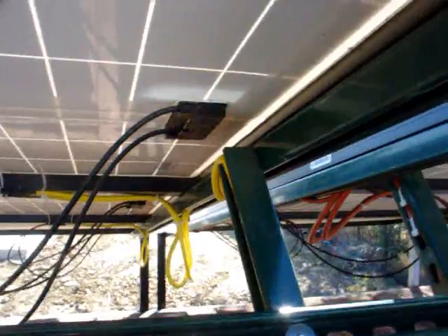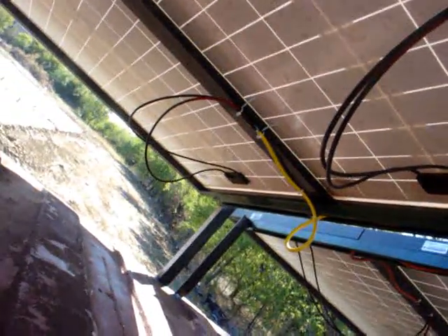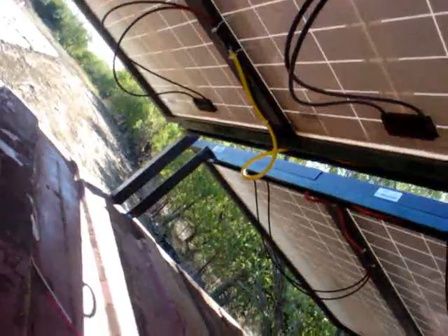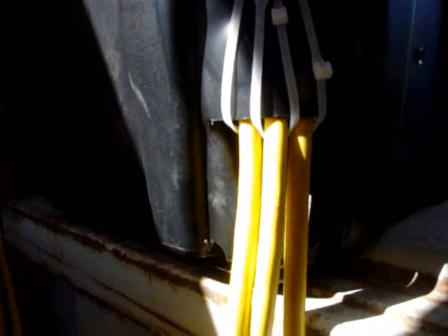Now that it's daytime we get a much clearer view. Two drip loops for this panel and this panel, set right there, and the connections right there. The last drip loop down there goes for that panel. See how the wires come around and go right into there, then right up the track. One more thing I just did: I drilled holes right there to let water out — for any water that gets in, condensation or otherwise. The bottom edge of the hole goes right to the bottom layer to help it drain. This is the lowest corner. These are all separated and in order, tie-wrapped and crisscrossed, looking real good.